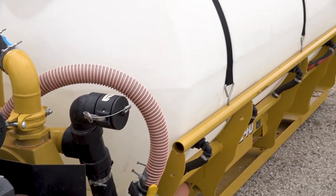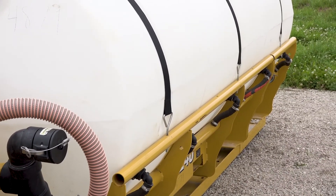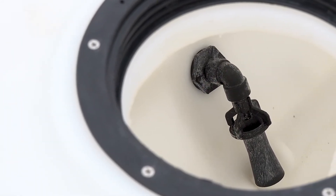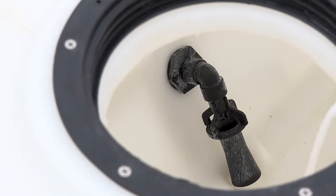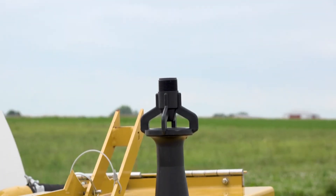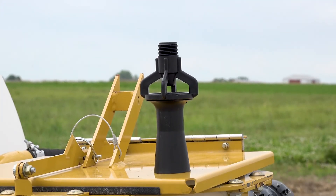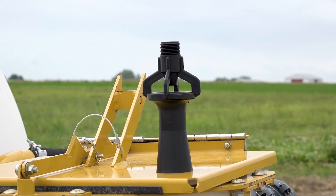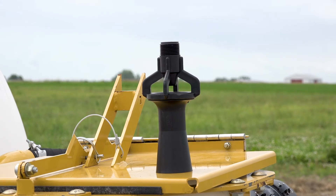The last thing I'm going to explain is how the nozzles work. Let's look at inside the tank and see how they are angled and positioned. The angle allows the nozzles to create a rolling effect in the tank, which is beneficial because it helps keep the fluid mixed during the drilling process and reduces settling of the additives. Here is a nozzle up close. Another feature is that when fluid is coming through the center, it is also pulling fluid from the back side of the nozzle. When the fluid is pulled in through the ribs on the back side, it helps break up the additives without causing them to be broken down too much, like the Venturi can.